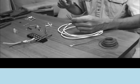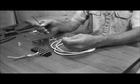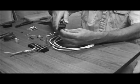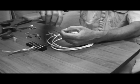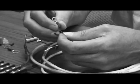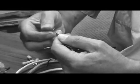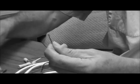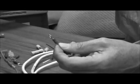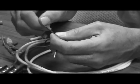Sometimes you're dealing with smaller wires. This happens to be number 14 wire, and this is probably 18 gauge — very small wire, very difficult to work with. You see the strippers don't even really strip that off very well. So when you have a very thin wire like that, even the small pink connectors are very loose on there, and the wire doesn't really fill the hole on the inside of that connector very well. So what I'll do is, with my thumbnail, just kind of crimp that wire over. You can see I've started to bend it, and I'll fold it all the way over itself — that doubles the thickness of the wire. Then when I put the crimp connector on there, it's a nice tight fit, and when I crimp it, it will now stay on there. I even have a little bit of the end of that wire sticking through there. That's a nice tight connection.